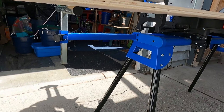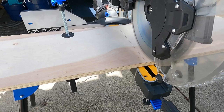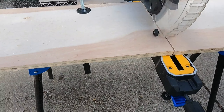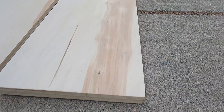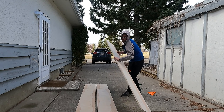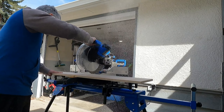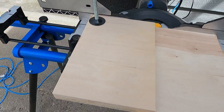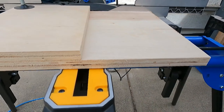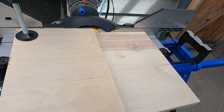I've got my wood lined up nice and level on my chop saw and I've got my line marked out. Now I'm just going to lay it on top of my next board because I need three of them the exact same height. I want to save some time especially with some of the smaller cuts — line up the shelves on top of one another to where the chop saw blade will fall. This is also a good way to make sure the shelves are exactly the same size. I'm using an eight inch shelf to cut an identical eight inch shelf underneath.